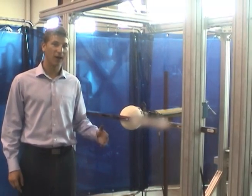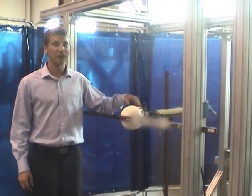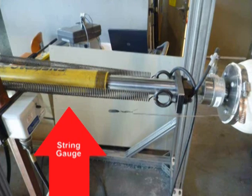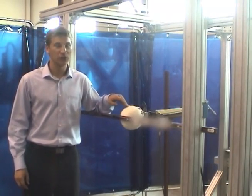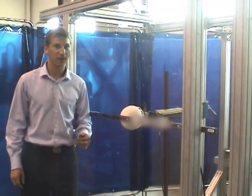First is the force applied on the hockey stick. The load cell at the front of our hydraulic actuator is going to give us the reading in pounds of how much force is applied. The second variable is displacement. We have a displacement measuring device hooked up via string to our pad, which is going to tell us in inches how far the stick travels — so we'll know how far the stick flexes and the amount of force required to flex it that far.